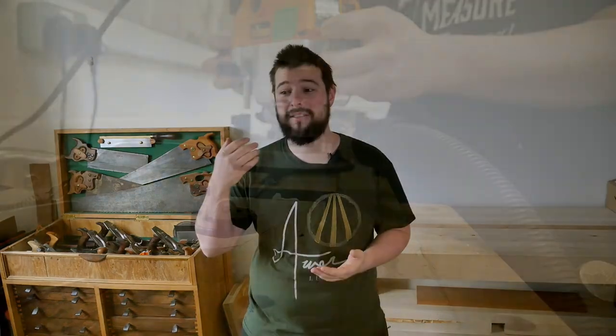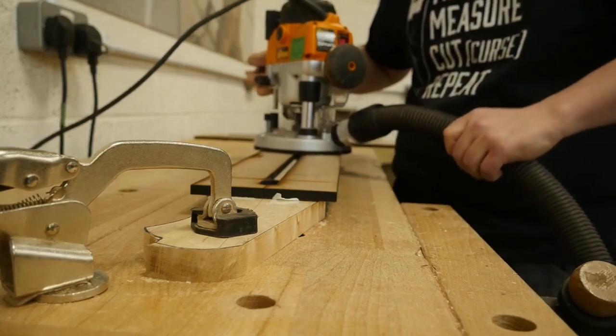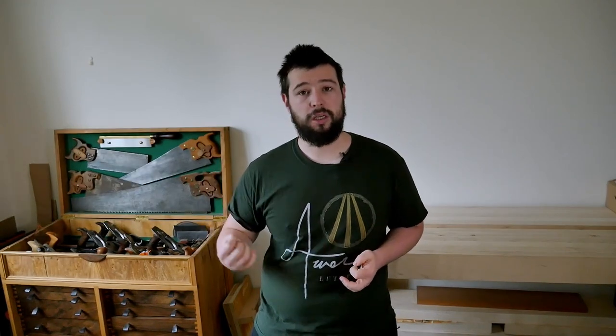Next up on my list, one that I think goes very well with the bandsaw — it's kind of one and a half tools. It is a router and also a router table. These are effectively the same tool brought together or taken apart, whichever way you want to look at it. A hand router in your hand, using with templates and a template bit, you can do pickup cavities, routes for anything else you need, neck pockets, truss rod channels, headstock access to your truss rod — anything like this. A very handy tool. A router can do pretty much anything if you get inventive with jigs and templates.